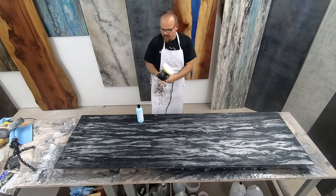You really nail that natural stone appearance — it's not too shiny, not too dull. We're going to use our final touch: Liquid Smooth. We spray that on there and when we wipe it off, it just makes everything glide on it. It's a really good finishing touch spray — we also do this before parties, showrooms, or anywhere you really want your counters to look outstanding. You can find it on our product page along with our compound. We've used Meguiar's 105 in the past — it's a great compound — but we love the sheen our product gives, and it has a very long working time. You don't have to apply as much and it doesn't get all over you. When we used Meguiar's, it would spit all over the kitchen; this one tends to stay where you put it, which helps a lot on site.